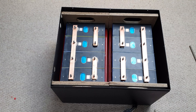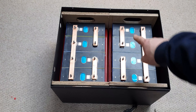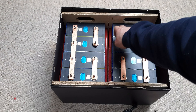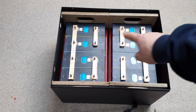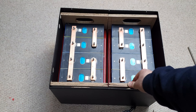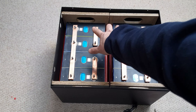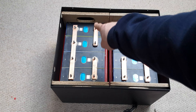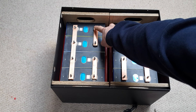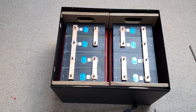So there is another 6.66 volt battery there. Now what we need to do is join these two packs together. The join link will be between here and here — the negative of this pack to the positive of this pack. For this I'm going to use a flexible cable because there is a little bit of movement between these two cells. I'm going to try and pack them out as best I can in this case, but they can move around just slightly. If I put another copper bar across there and they do move, there is the possibility that I could break those two terminals in the top of the cells. So I'm going to run probably two 70 mil squared cables between here and here to bring the two packs together to give us that full 2P4S, 14-ish volt battery.